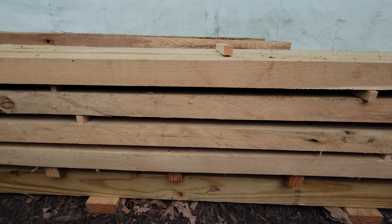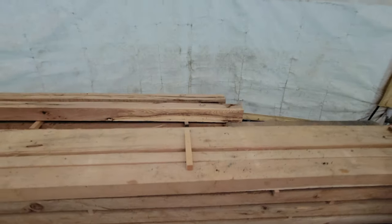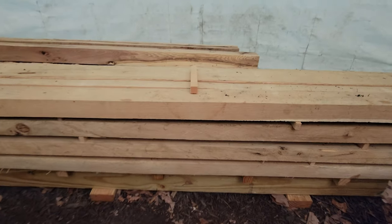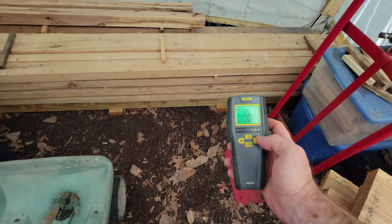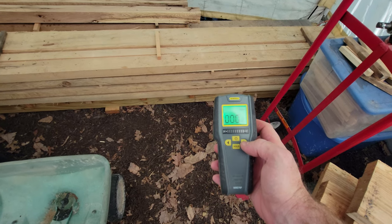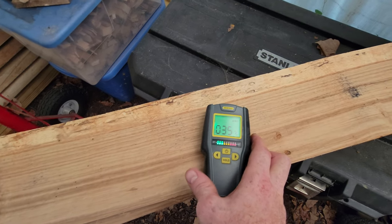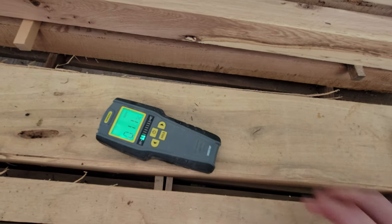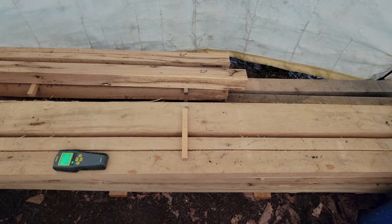Stickers are very important, and it's good to put some heavy weight on top to keep the boards flat while they're drying. To get the right moisture content, it takes about a year per inch of thickness. These slabs have been here about two years and they're about two inches thick. I'm using a pinless moisture meter — set it for hardwood — and this freshly cut white oak reads 35%, it's soaking wet. The wood that's been drying for several years reads 14%, and I've seen it as low as 11 or 12% — that's pretty good for outside work.